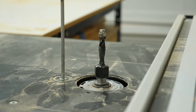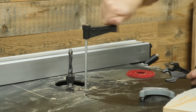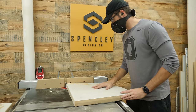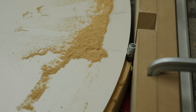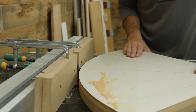For everyone asking what I ended up doing for my router table fence, I just clamped on some scrap pieces of MDF to my table saw fence. It's not pretty, but it works great. The flush trim bit removes all of the excess MDF from the template, leaving a perfect match of the curve above. And with that outside curve complete, here comes the challenging part — I need to somehow accurately cut out all of the grooves for the wine bottles to rest in.